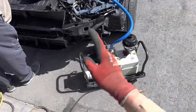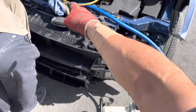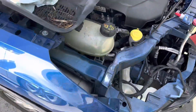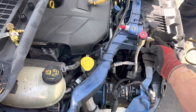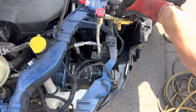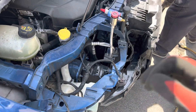On the other vehicle I'm doing the one-hose method — one single vacuum pump, one single hose to the low side. You can see the high side valve right here, and I'm going to add one hose to the high side using a ball valve for isolation. That'll be the method covered on the next video.